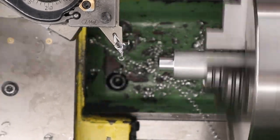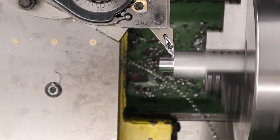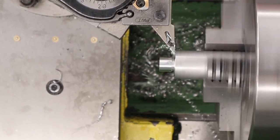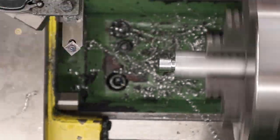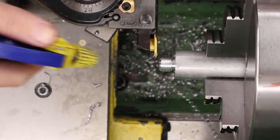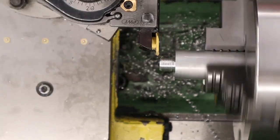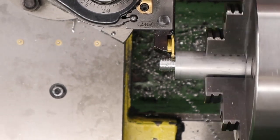The first part we're going to be making is the end cap for the shroud, and this needs a half inch UNF on it and a boss on the back to fit into the carbon fiber tube. We're going to be turning the half inch UNF on the end first — we've faced the material and then we're turning the diameter down to 12.7mm. Once the back face has been finished we can turn a little undercut for the thread to run into, then finish it off with a 45 degree chamfer on the end. We're single point cutting the thread using a full form insert, taking the passes nice and gently, and using a little bit of WD-40 to stop the aluminium from sticking to the tool.